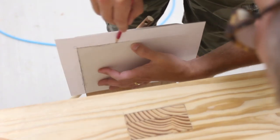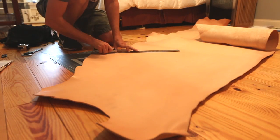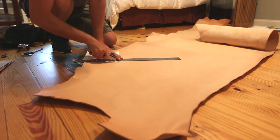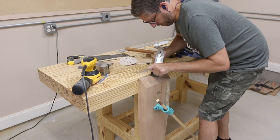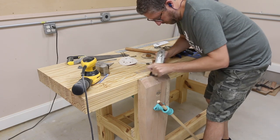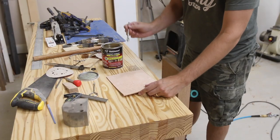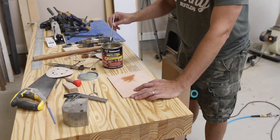Next it was on to the leather. I used a piece of paper and created a rubbing like you used to do in grade school with leaves. This allowed me to see exactly where the edges of the leg vise were with no measuring. I took that paper to my leather and cut out a piece that was just slightly larger than the marks. I wanted a little bit of extra so I could trim the leather flush at the end for a more perfect look. This is just some really thick veg tanned leather. Then I used a hand plane to flush up the leg vise to the workbench top.